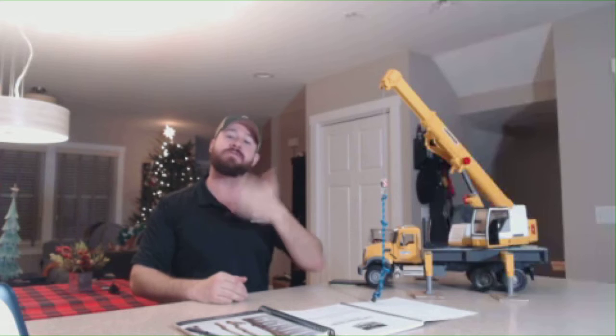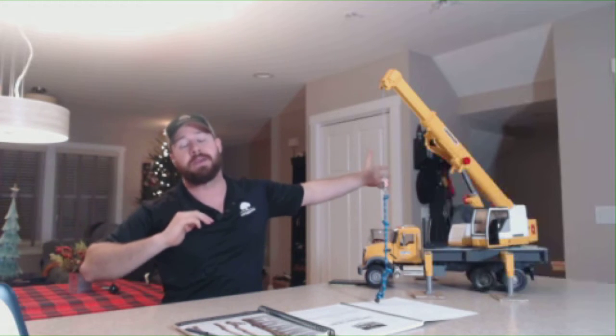All right. So don't be giving signals such as this. It makes it very hard for the operator to see, especially at a distance. And if you're wearing black attire like I am today, it'll be very hard for an operator to see that. Hopefully I'm wearing my high vis, it'll be a little easier, but still make the motions very dramatic, make them very big.